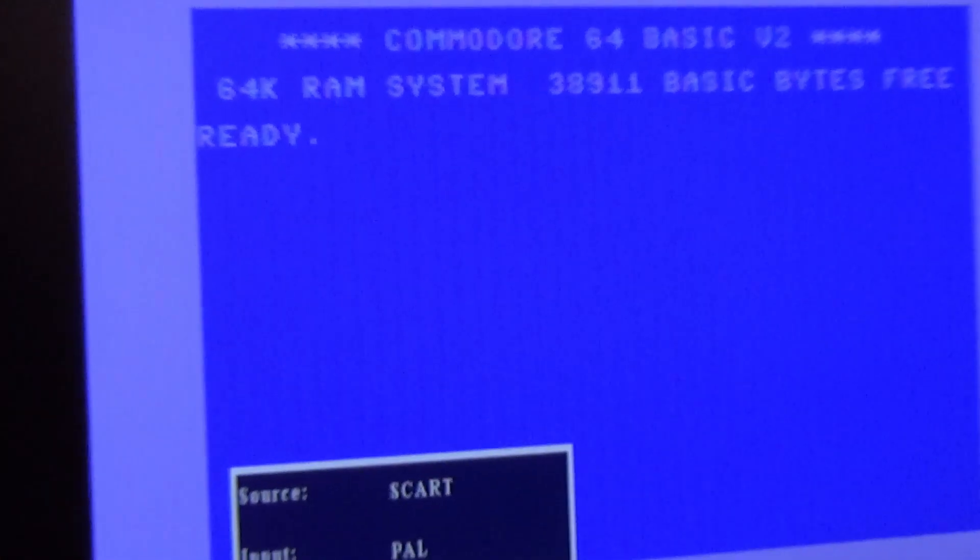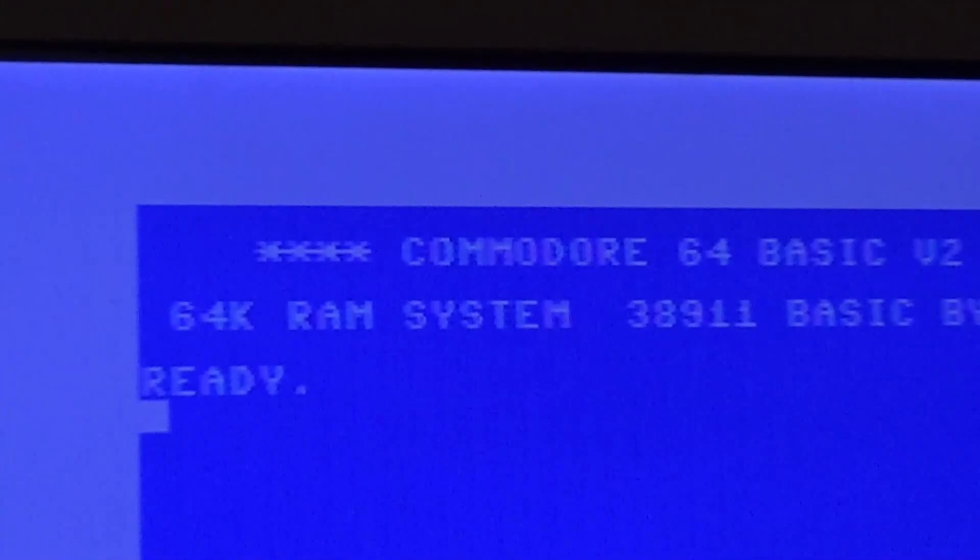The video output is really bad. That's with an S-video cable where the chroma/luma has no adjustments or anything. That checkerboard pattern you can see is caused by the luma signal being too hot or something. It doesn't look good at all. If you zoom in, this is more like what I'm looking at - it looks absolutely horrible.